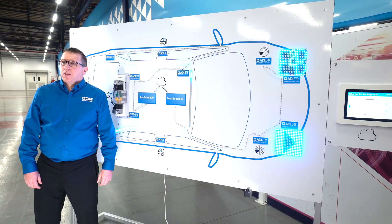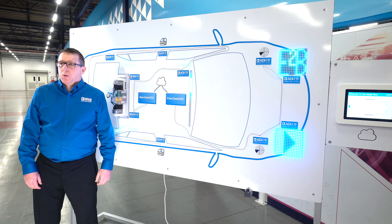This is achieved by removing the complexity on the edge nodes using ADI's low-complexity Ethernet technology. E2B incorporates a fully compliant 10Base T1S IEEE 802.3CG Ethernet PHY as well as the MAC supporting point-to-point and multi-drop format. The bus operates at 10Mbps over single unshielded twisted-pair cabling.